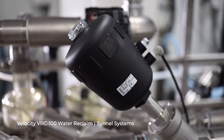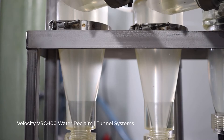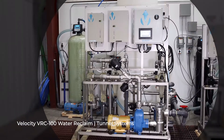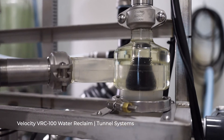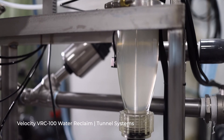Fast acting angle body valves supply the water to the process cyclones. Process cyclones deliver the water to the car wash whenever the conveyor system is running. Cyclones to the right are circulation cyclones, delivering 35 gallons a minute of water and up to 20 liters of air and ozone back to the tank for oxygenation and clarity.